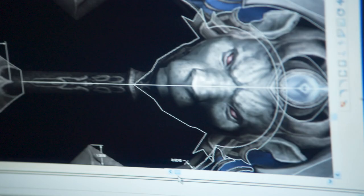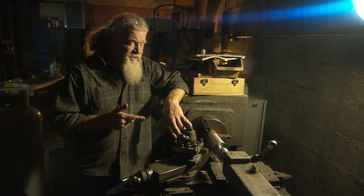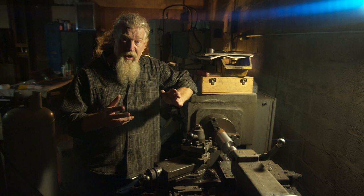We don't have a lot of round parts on this weapon, but we do have a piece on the handle — it's kind of a ferrule at the top of the handle underneath the chin of the lions. It ties really the entire handle area and that entire guard section together, and all the pieces come up to it and blend. So it's a pretty important part. I've got some oversized stock — I'm about three inches here and I only need two and three quarters — so I'm going to cut it down to size, cut the basic form of it, and then make a ramped angle that's going to go underneath the chins and tie the whole thing together.